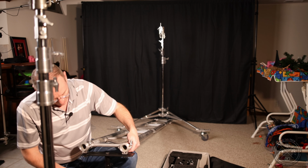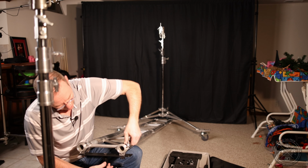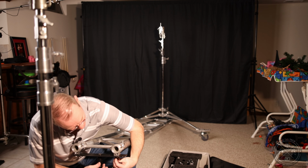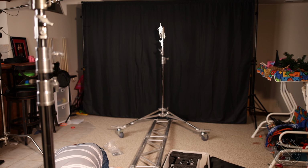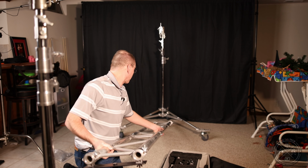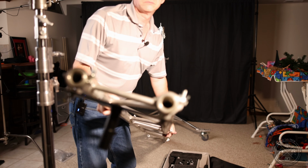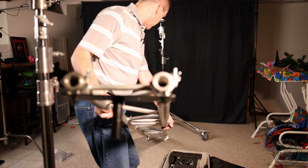So you probably couldn't see this, but I put the pin on the floor and then loosened the clamp. And what that allowed me to do was just get to the point where now the clamp was square on the plate. So that's kind of a little cheat you can do so that you can make sure that that is flat. You will want it flat. There we go. So the first side is connected. I will hold it up so you can see it. And pull this your way a little bit so you can see that a little bit better. So that is side number one.